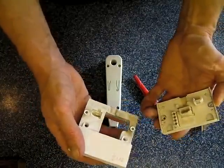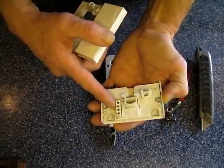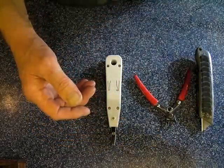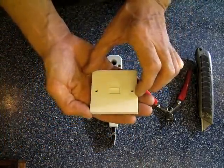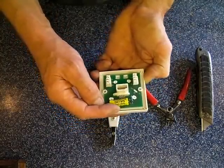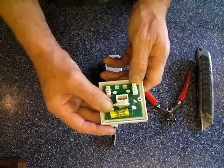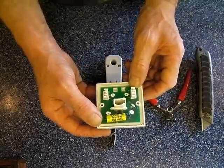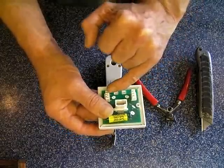Other extensions that you might have off your cabling will come in through the box, come out here and terminate on two of the pins here. Your extensions might be this, which is a 2/2A. Notice it has a capacitor on there — I always recommend you have the capacitor. This negates the need to connect pin 3, which is the bell wire. Most phones these days don't actually need this, but if you use this then you won't need to worry about the bell wire, which can cause a lot of problems. So we're just going to be terminating on pins 2 and 5.